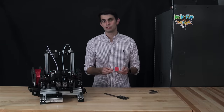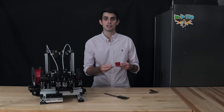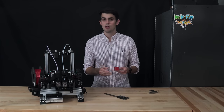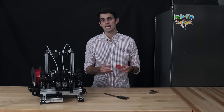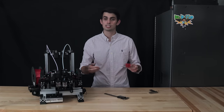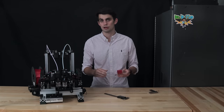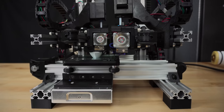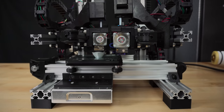It's relatively safe to assume that once you have successfully printed a cube, then your printer and firmware configuration files are set up correctly. From this point on, you shouldn't have to edit the firmware's configuration. However, you will have to edit the settings in your slicer to really hone in quality prints. After the cube, I always print the world-famous Benchy to determine what slicer settings need adjusting.